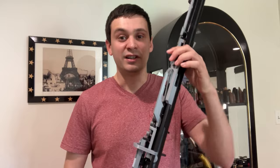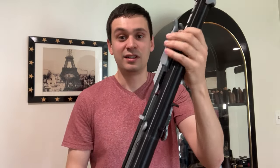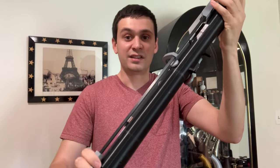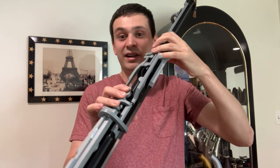Another cool feature I'd like to talk about is how I did some of the longer rods on this instrument. With a 3D printer, you're very limited in how big you can build some parts. Things like the body joints are made in sections and then glued and pinned together. But keys are a little more tricky — it wouldn't really be practical to just glue plastic pieces together because there'd be too much flex. The best example is the rod for low B and left hand E flat. The touchpiece is up here and the pad cup for the low B is down here. What I've done is 3D printed the pad cup, touchpiece, and key arm, but the rod itself is actually a piece of carbon fiber tube that translates the force. So even though it has 3D printed touch pieces, it's actually a fairly stiff key with not a lot of flex. I'm definitely going to be using that on other projects like the Octo-Contra clarinets.